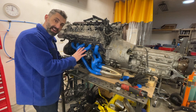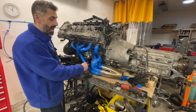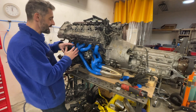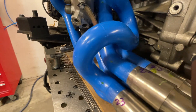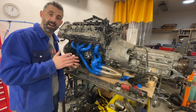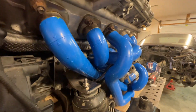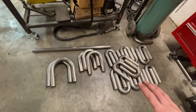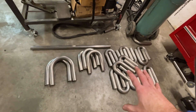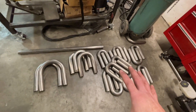We've got a lot of 2-inch bend radius tubes, some 3-inch and 4-inch, and a lot of straights. Here are my tubings — all from JMD Tubes, linked in the description. These are all 1 and 5/8 inch mandrel-bent stainless steel 16 gauge, which is basically 1/16-inch wall thickness — that's on the thicker side, which is what you want. You want the thicker type because it's going to be handling a lot of heat and needs to handle it without warping, bending, breaking, or cracking.